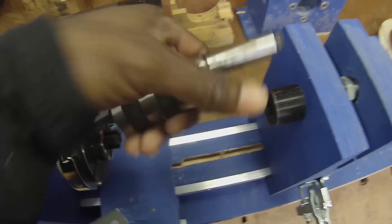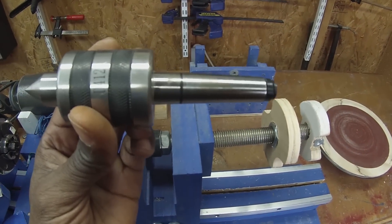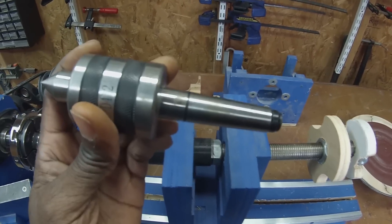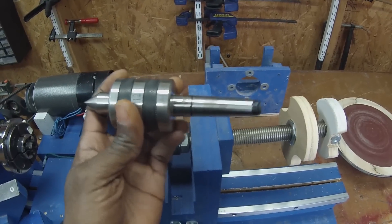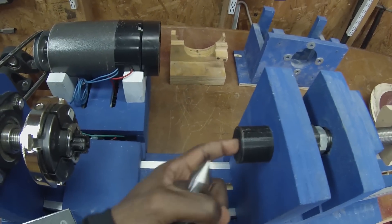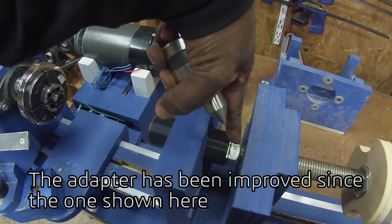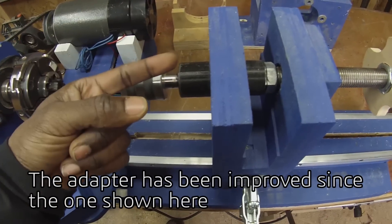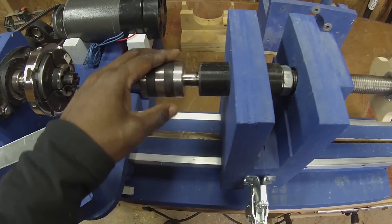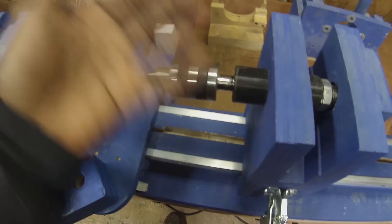It was important to me to be able to use a real live center. This has an M2 taper on it. If you're a machinist, you know exactly what that means and how to make one, but I don't have any tools that would allow me to cut that accurately. I spent quite a bit of time thinking about this problem before I decided to model something and have it 3D printed. This is a plastic piece that has an M2 taper on one side and a slot for a coupling nut — a one inch coupling nut — on the other side. If you want to do the shop made version, you won't need either of these components. But it was important to me that I could hold on to a live center or a drill chuck designed to have an M2 taper.